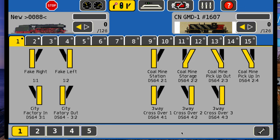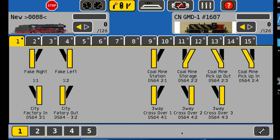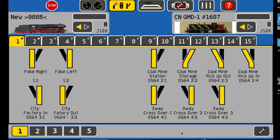Because of that versatility, there are solenoid turnouts which have a little magnet motor that throws the switch very quickly — usually snaps. Kato, Bachmann, and Peco have them, and you can also buy the motors separately. The other type is slow-motion servo switches — for example, the tortoise switch machines are servos. You can also use RC servos if you want. With servos you need constant power, whereas with solenoids you just need a burst of electricity to throw the magnetic switch over.